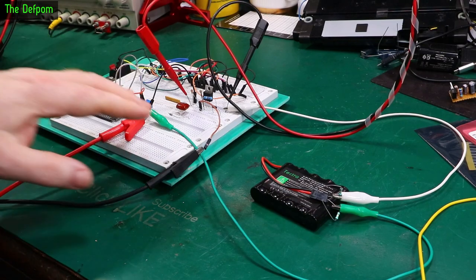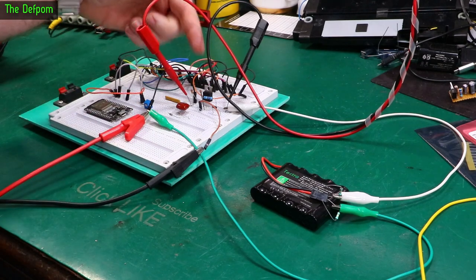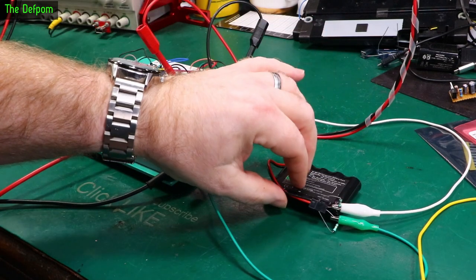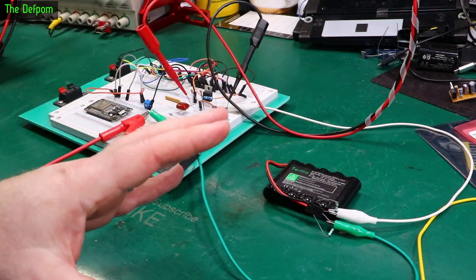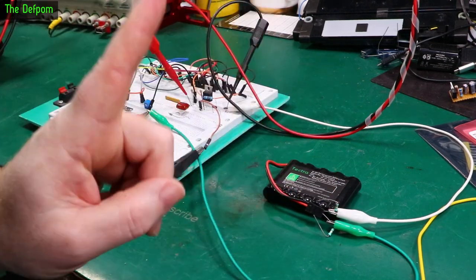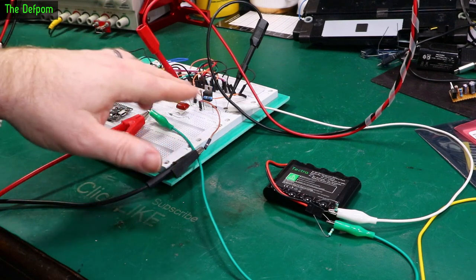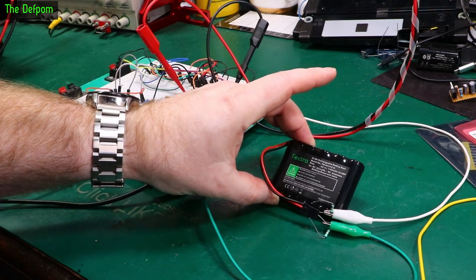One eternity later. Right, here on this breadboard I've got a little regulator mocked up. So this is actually functioning, and this is currently charging this battery. It's been on charge for almost a day now. And I'm just monitoring the actual current usage. I've already simulated this with my DC electronic load, and I'll show you that in a second up there, just to show you what it's doing. I'm sure I've got the right values and stuff I need on this to actually get this 6-volt cell to charge nicely and not overcharge.